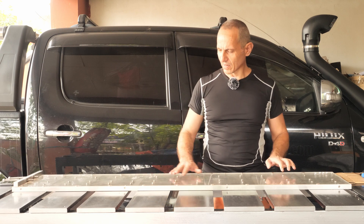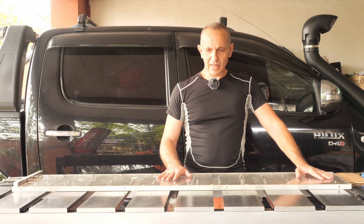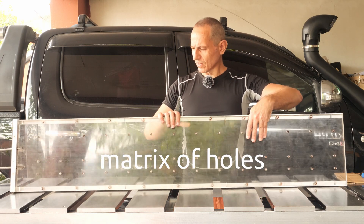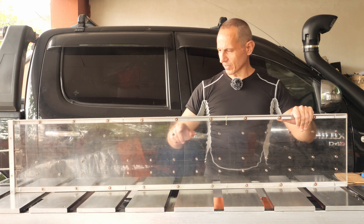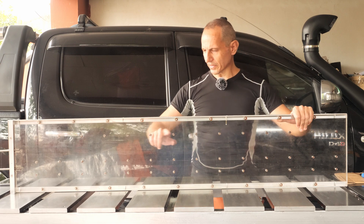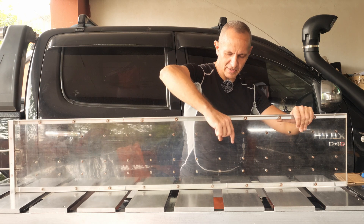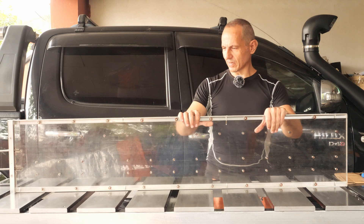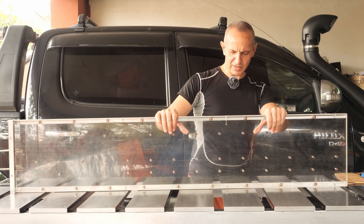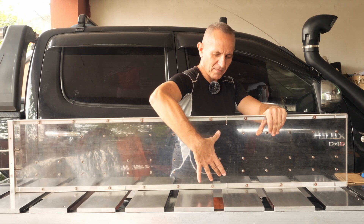Because the acrylic surface is slippery, it was important to come up with the idea to clamp the piece to the jig. I drilled a matrix of holes which are four inches apart, and I made three rows. The third row is two inches apart, so we have four and four inches and two inches here, which gives me a lot of flexibility. I can joint or thickness plane very narrow boards, medium width boards, and wide boards.